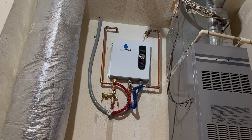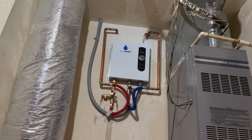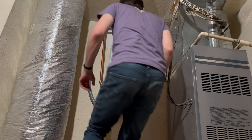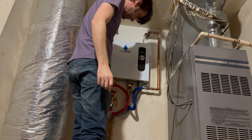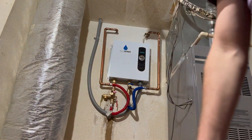Now everything is connected — this is roughly what the finished product looks like. So, all set, right? Not quite. I turned the water back on and found several leaks in my connections. I spent a good part of the rest of the afternoon tightening and reassembling all of these different parts, and finally I got the leaks closed up to my satisfaction. One lesson here is to try to avoid this complicated setup with so many connections. Try to plan ahead so that you can make as few connections as possible, and consider trying to find compression fittings so that you don't need these metal-to-metal and plumber's tape connections. If you have some tips or if you can point out how I did this wrong, please sound off down below in the comments.